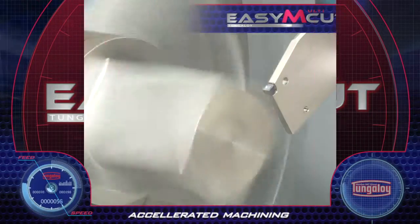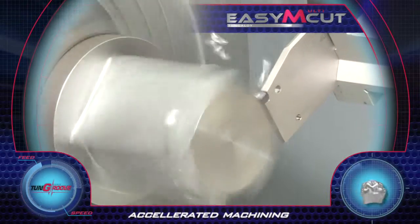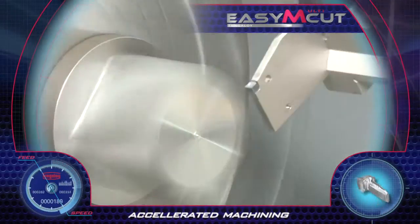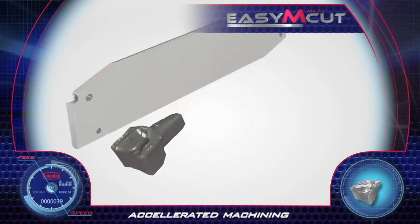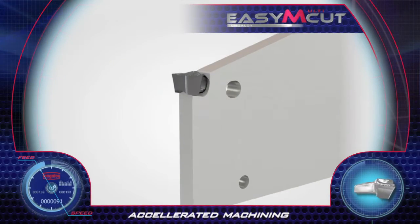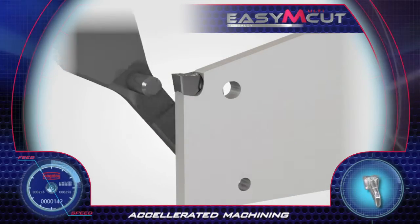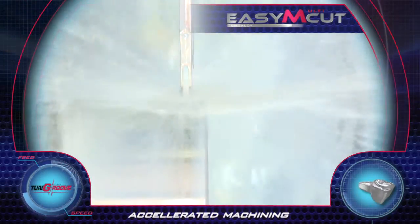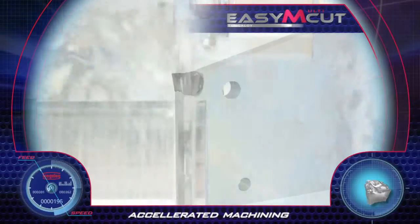Tungaloy introduces its latest grooving tool lines for accelerated machining. Easy Multicut. Tungaloy's new Easy Multicut system for parting, grooving, and turning applications features a robust insert clamped in closed pocket structure. The unique insert clamping improves tool rigidity, allows longer blade extensions, parting straightness, and high surface quality. The jet coolant option in the tools enables increased feeds and speed rates and prolongs tool life.